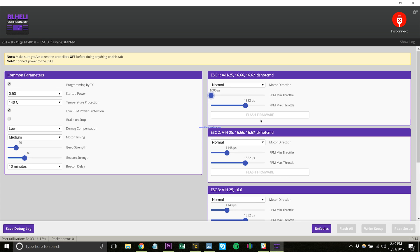While we wait for that, I always go ahead and set the throttle range to 1000 and 2000. It's not allowing me to do exactly 2000, so 2004 is fine — I don't ever have any issues. I just do this so that everything is set the same.